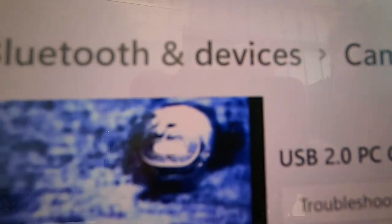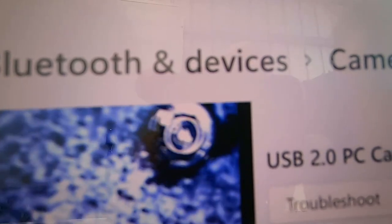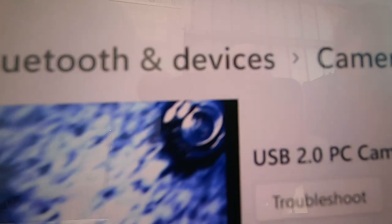It's a bit tricky to hold this still and see, but you see there's a lock nut. It's a lock nut and a big stainless steel washer we got on there now. So that's got Loctite on it as well, and it's Sikaflexed in there, so that shouldn't go anywhere.